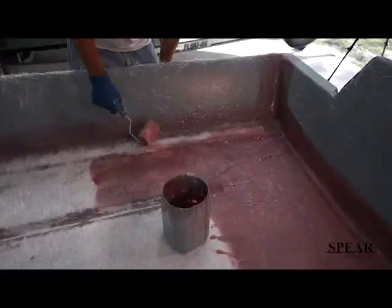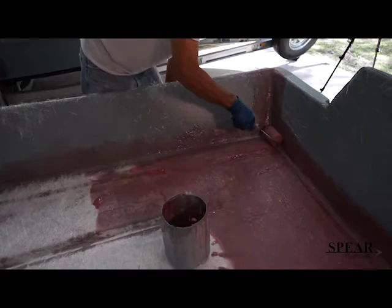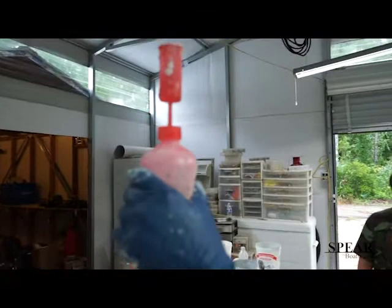This is what you need to know about applying resin and then using the ridge roller. Don't try to roll it too dry from the beginning. Just try to get it on there and then spread it. During the summer, I use Cat 11 as my catalyst. It's got DDM9 in it, but it also has a retardant to slow it down. And I mix that at 1.5%. Always use milliliters to measure your resin and your catalyst.